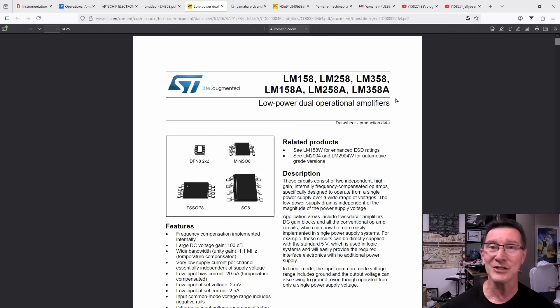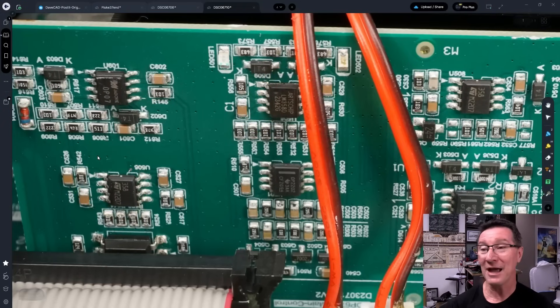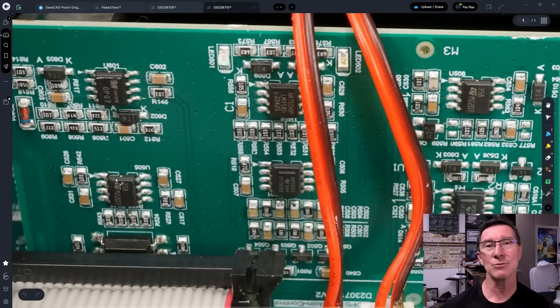When purchasing, people send all the reels to the assembler, or the assembler can do the parts supply for you and order them all. Then they're going to put their barcodes on there, and that barcode for this reel of ArtsChip LM358 is going to be exactly the same barcode as the ST ones. So to the assembler, it makes absolutely no difference whatsoever — this is an identical part. And that is how we've ended up with multiple LM358s on the one board. You might think that's weird, but no — if they've designed it that way intentionally requiring different specs, then they've designed it very badly, because the LM358 is a jellybean part and not a precision part.